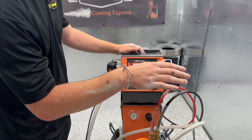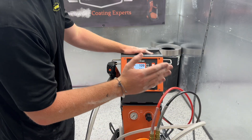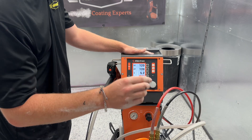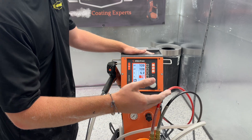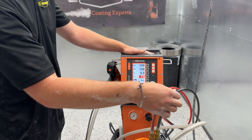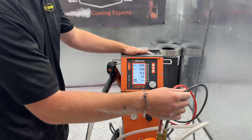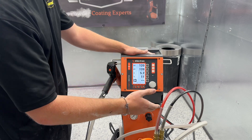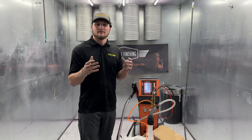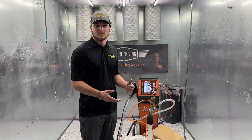The remaining 40% goes in here around the pump insert — that's more of an air assist to help push the powder all the way through your powder hose and out of your gun. As you increase the total air number, you're increasing total air throughout the system, which means you're going to be spraying more air and probably more powder. But as you decrease it, you'll have a lot of extra push air with no powder behind it, so you need a good combination of these settings to make your powder cloud how you want it.